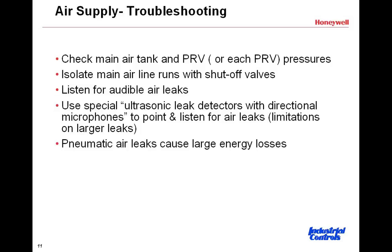Ultrasonic leak detectors are available to help find smaller leaks, but sometimes the easiest thing is to use a pressure gauge and systematically isolate portions of the system until you restore pressure where it should be. Obviously, you should also see runtime differences — this is a real obvious indicator. If the compressor is running all the time, you know the air is leaking somewhere, and it's costing energy not only for compressed air but in terms of building comfort.